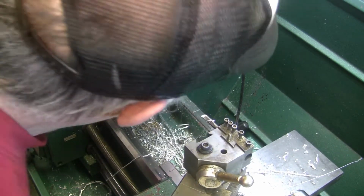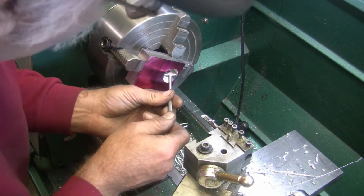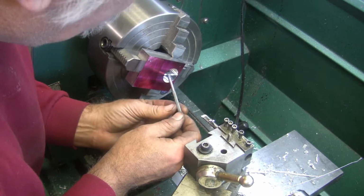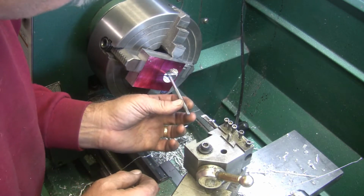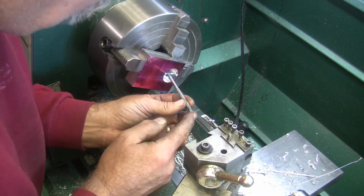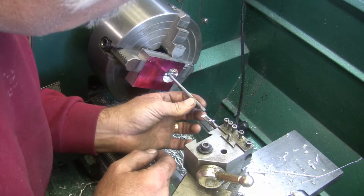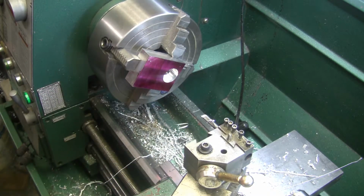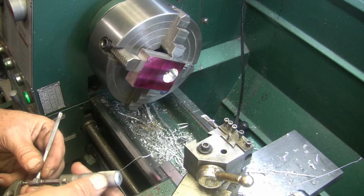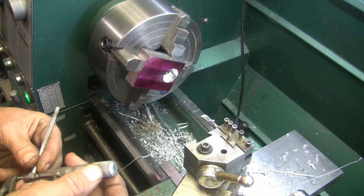And we'll give it another check and see. Plus, when you're doing snap gauge work, you put it in at an angle, tighten it, and only drag it through once. You don't drag it through twice. That'll measure the diameter of the hole. And you don't need to over tighten it like I just did. Ooh, just about dropped it. And we are at 1 inch, 100.